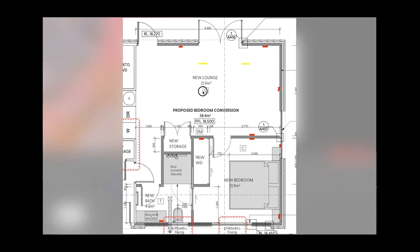We've chosen to have four lights in the lounge, and I want to talk through where you should place the light switches. In a scenario where you have a bedroom with two entry points, make sure you have a light switch at each door. We forgot a light switch here and it's really painful — at night when you enter through the door you have to walk all the way to the other side of the room to switch on the lights. It's just not a pleasant experience.